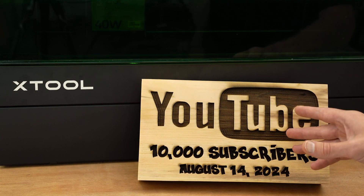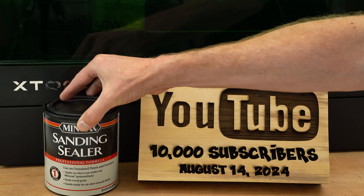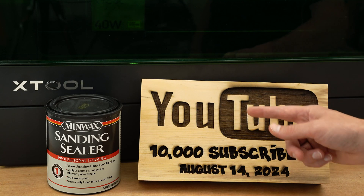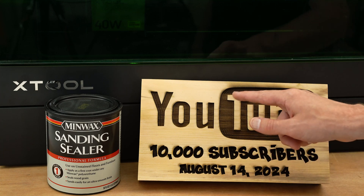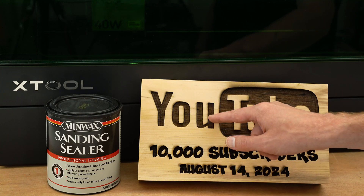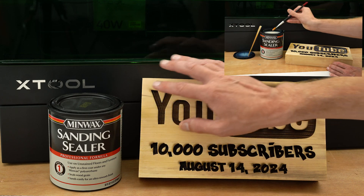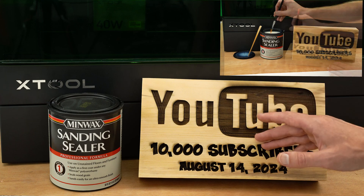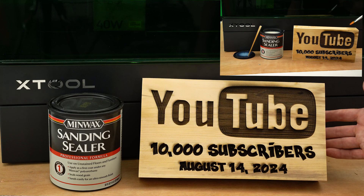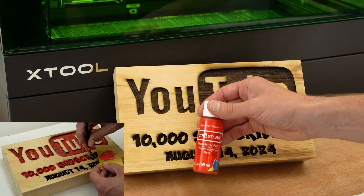Next, I'm going to show you my secret step on how to get the perfect color fill on all of these numbers and letters. A little while later, the plaque is all dry, and for the secret step I am going to be using some sanding sealer. What this is going to do is plug all the pores in the wood so that, in the next step when we color and fill all these areas, the paint is not going to be able to seep into the wood, creating a hazy outline around all of our different shapes and letters. When I apply the sanding sealer, I'm going to get inside all the letters, across the top surface, and because it also produces a really nice finish, I'm going to get all of the other surfaces on this plaque, including the back side. The sanding sealer is all dry, and I can apply two light coats of some nice red paint.